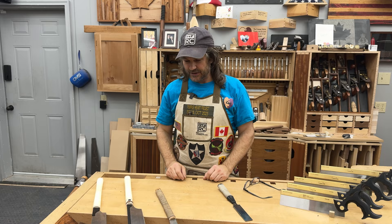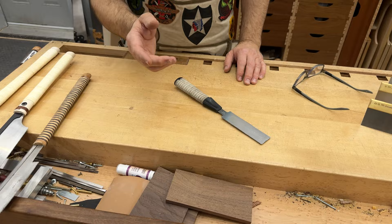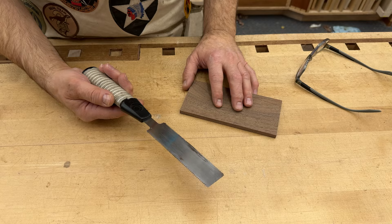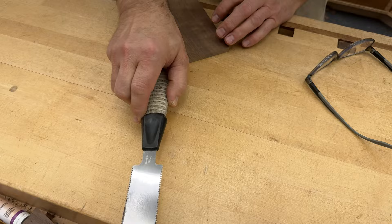Trying to put two non-flat surfaces together, you don't have a great joint. So I am not a fan of eastern-style pull saws, but there is one exception — this is what's called a flush trim saw, and I would consider it a necessity. If you're trying to flush off a dowel plug or anything where you've got to cut right up to the surface but don't want to leave a mark, these don't have any set on the side that goes down. You cannot push these because of how thin the blade is, but you can pull them.